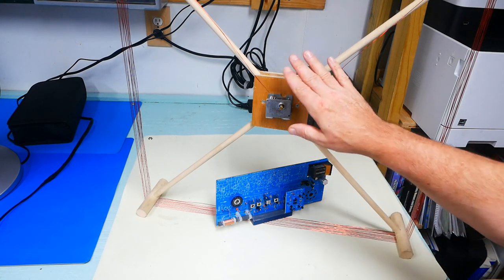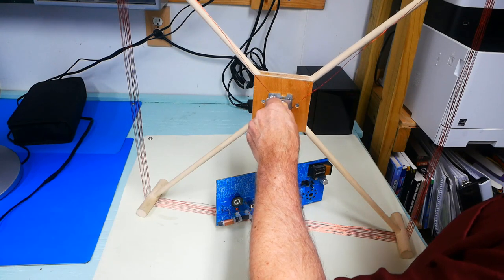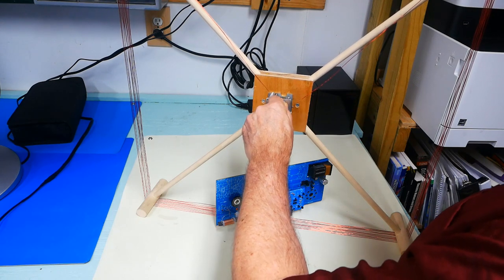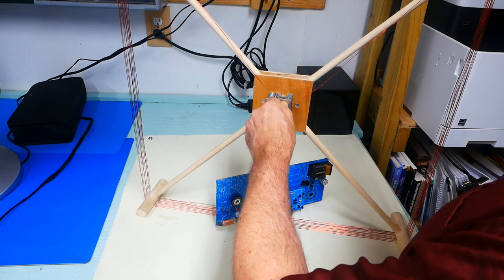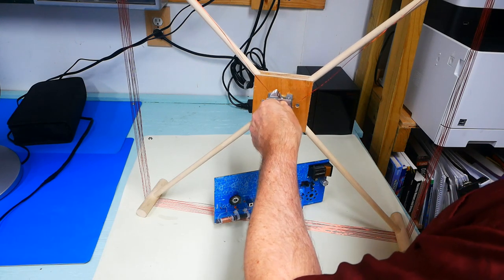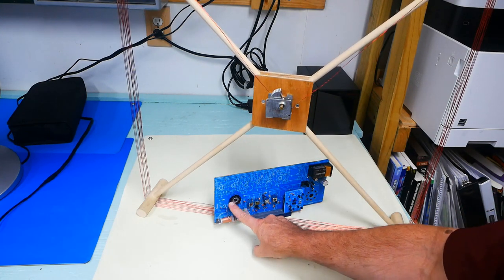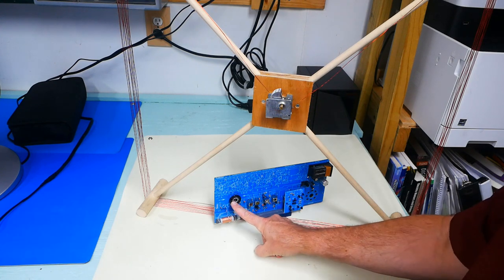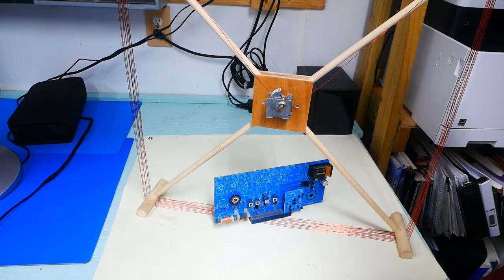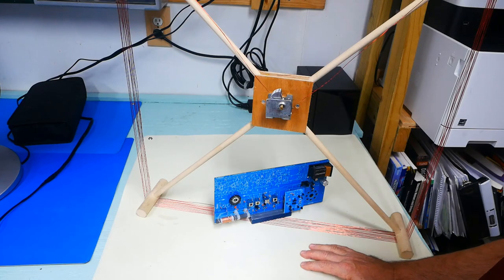And to prove to you that it's actually the antenna amplifier doing this, if I change the tuning, you can see that the station has actually disappeared now. And the way you can find out what station you are going to be listening to is if you pick a random point on the dial, so let's put it about halfway, and tune through here. That point where you're getting the most static is the frequency that you're going to be amplifying, because it's picking up the static in the air and amplifying that. So it's a pretty simple device. It's just resonant at whatever frequency the inductance and the capacitance are tuned to, and this will cover the entire AM band plus a little bit extra on either side.